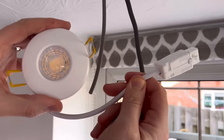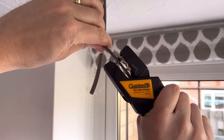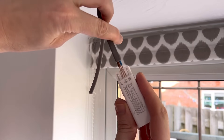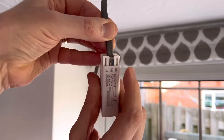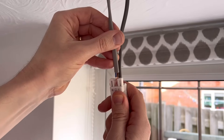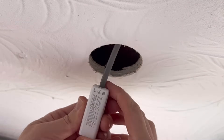It comes with the plug pre-connected to the fitting and the socket half is included in the box. This socket features the innovative Quickwire shuttle connection. All you do is strip the cable to the correct dimensions — made even easier with the Quickwire flat cable stripper — line the conductors up with the correct terminals, no earth-sleeving required. Once you feel resistance, check the sheath is within the cord grip and the conductors are visible through the little window, then just push the shuttle home until it snaps in place. If you're connecting up a fitting with another one connected to it, just repeat the process on the other side. If you're at the last fitting and the other terminal isn't being used, close that connection shut and it's good to go.